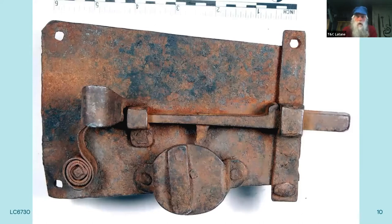Here's a very simple spring-loaded lock. The end of the bolt is square. This lock would be operated on the inside by the handle to the left. The flat coil spring is open — these were covered on some locks just to tidy up the look. The bolt has a talon that looks a little like a claw, reaching into the ward box and contacted by the key as it rotates. Because this is a spring-loaded lock, the ward box is asymmetrical since the key doesn't make a full revolution. The center pin is a T-shaped forging.